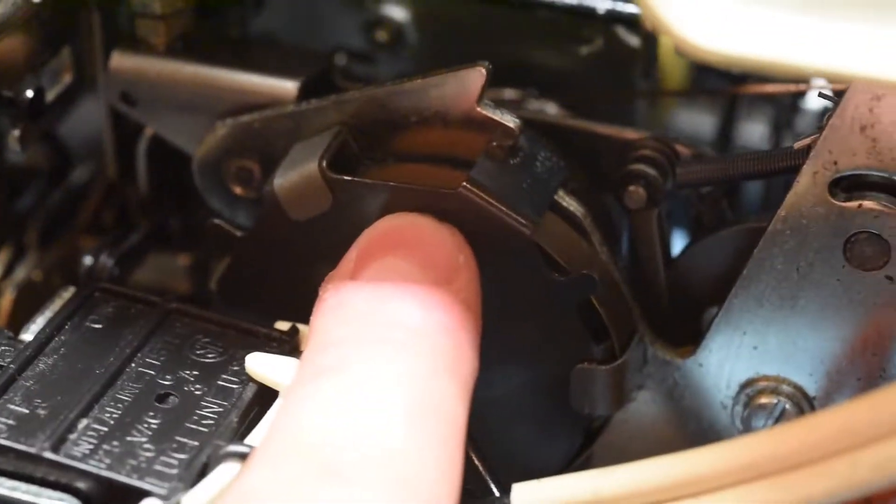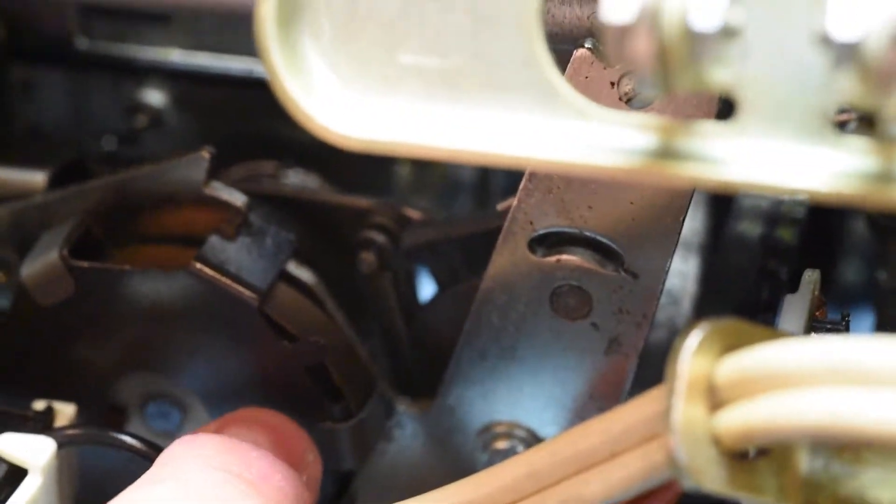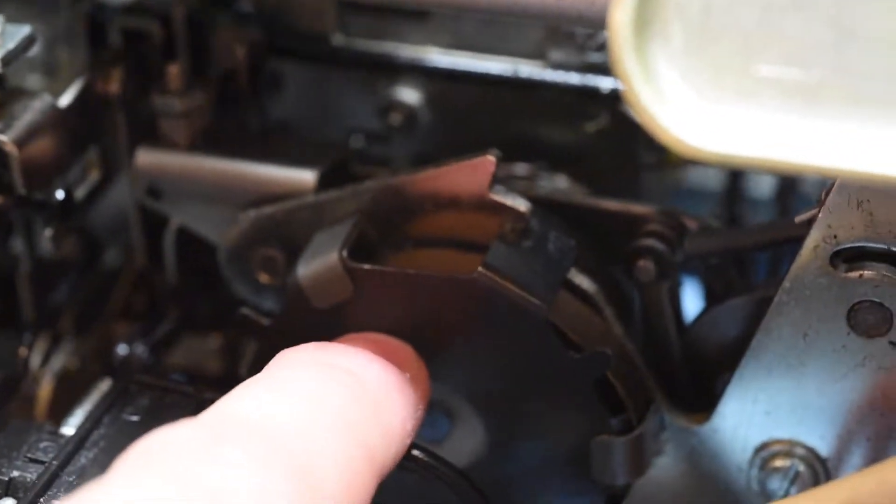Before I forget, there's one mechanism here — this spring. It's actually a leaf spring that's always wound. What that is is it drives the other pulley here to pull the carriage the other direction. So what that does is it's always trying to pull the carriage to the right position.